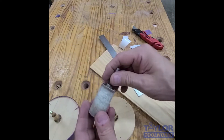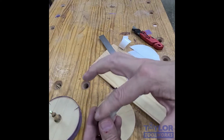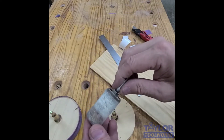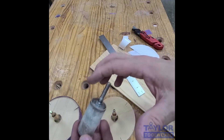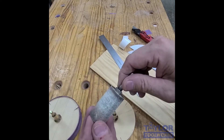By the way, you can also use this paper and just wrap it around small rubber drum sanders — it works great. You just stick a piece on, wrap it over, overlap it just a quarter to half an inch, and it'll be great. And when you do that you can use grits that go down, because with this 3M stuff you can get grits down to 400 and you can really polish wood with it.